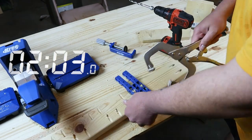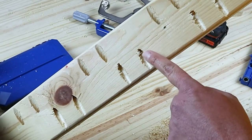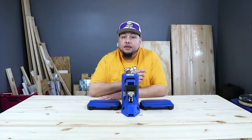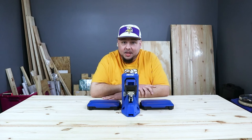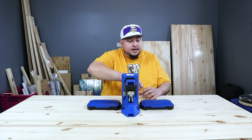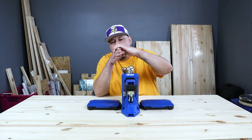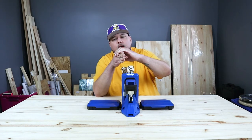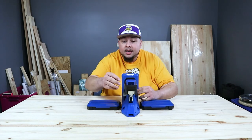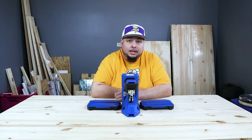Now you can even see the holes - they don't even look as good with the old one. Look at the holes compared up here: the old ones are all jagged and raggedy looking, and these new ones are looking nice. First impression: my old system with that little hold-and-clamp thing is so inconvenient. Even once you clamp everything down and get it dialed in, it's still sitting there kind of teeter-tottering, wanting to move. Also with that old system, it has little feet to hold to the other side of the board, but sometimes it comes off a little and the drill goes slightly off.